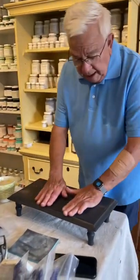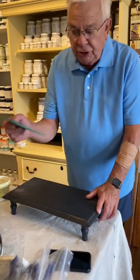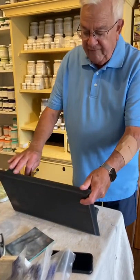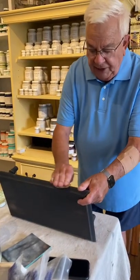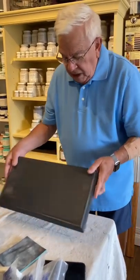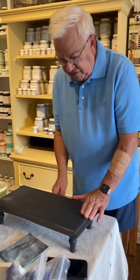So what we're doing right here, right now, I'm getting this prepared. I normally use the scuff sander, and I'll show that in just a few seconds, but there's a spot over here that's really rough and you just have to sand it down. This is 150 grit sandpaper and you just have to give it a little bit of love like that, and now it's really smooth. The whole thing is smooth and there's only one thing left to do with the heavy sandpaper.